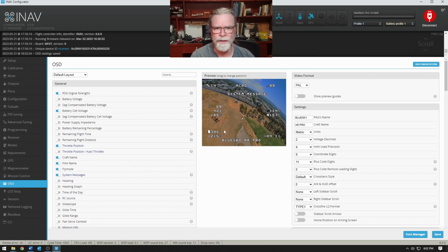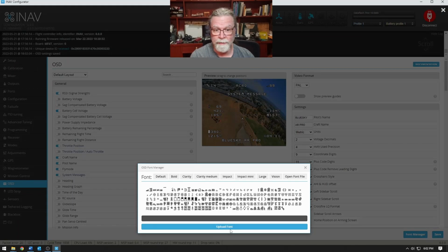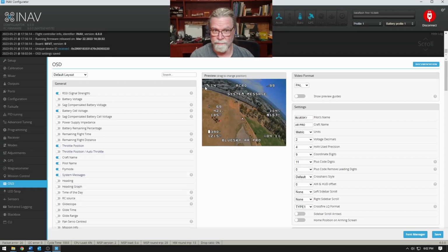If you're putting stuff on there and you see that these all look strange, or the fonts aren't quite right, or you're getting strange characters in here, just open up the font manager and upload a font. Typically the default is what many people will do. So if you're having any issues with your fonts not showing clearly, use the font manager to upload the fonts to make them clean again. Once you've done that, you can save it and that will take care of it. You need to set up the OSD the way that you need to set it up for your comfort and how you want it, and whatever you need to be able to see. But for me, this is how I'm going to do it.